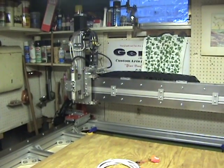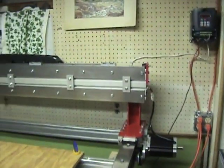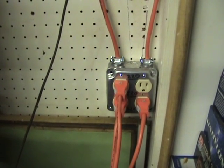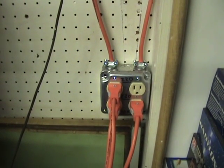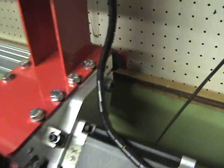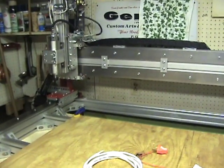Hello everyone. Got the spindle all set up, coolant supply and everything done. I went and added in another box in the back to plug in my pump for the coolant, wired in line over to plug into the outlet. I only have two poles coming off — the neutral is mixed with the ground and then one hot wire since that's 220 going through there. I also pulled the lead off and attached it to the back bolt, so now I have a ground in the machine.